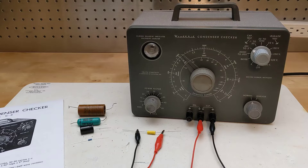Ideally this is zero, but for certain types like electrolytic capacitors it can be a few ohms to tens of ohms, and higher for bad devices that would otherwise still measure as having the correct capacitance value. Finally, certain types of capacitors are prone to being electrically leaky, essentially as if they had a resistance in parallel.